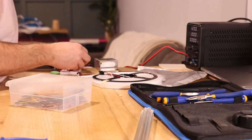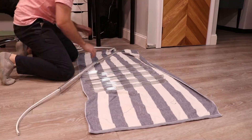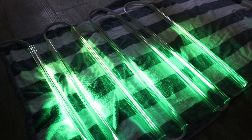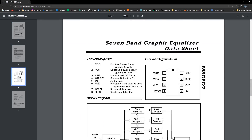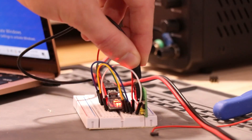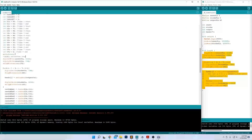The LEDs will be running off an Arduino. I then wrote a test program with simulated signals so that I could develop the LED animation. Once I had the animation that I wanted, I fed the rest of the LEDs through the tubes. I also played around with color palettes. I found this module which basically divides the incoming audio into seven bands of frequencies. All we need to do is feed it five volts to the input, and we can pull the data pins back to the Arduino. I then had to wire it into the circuit and updated the test code so that the LEDs would react to the data coming off the modules.